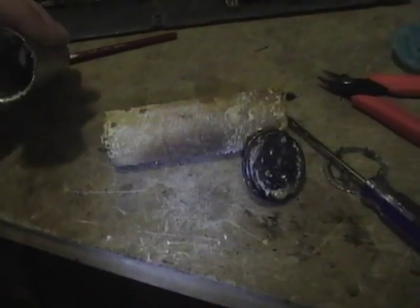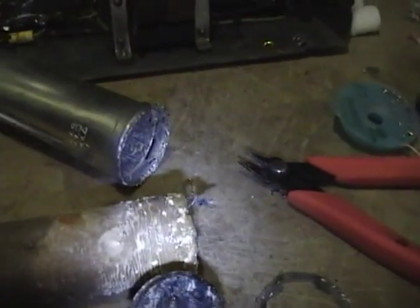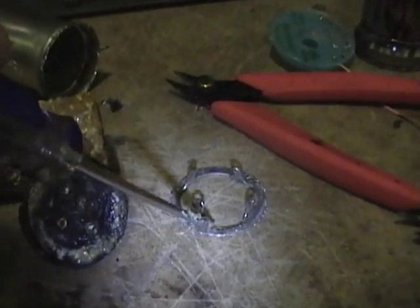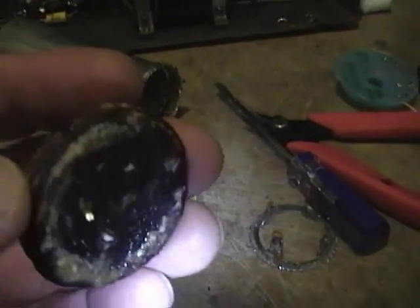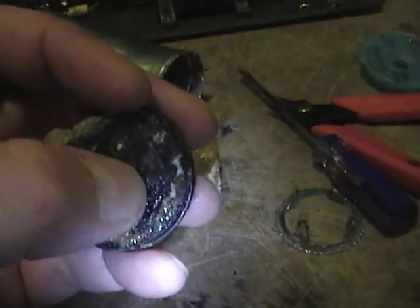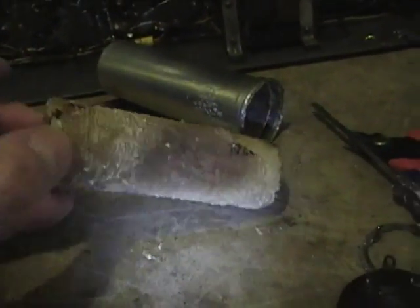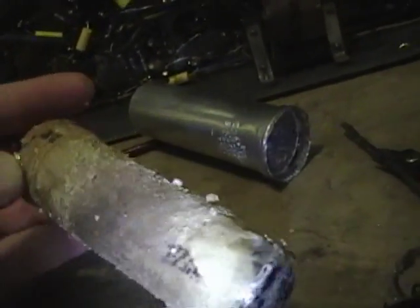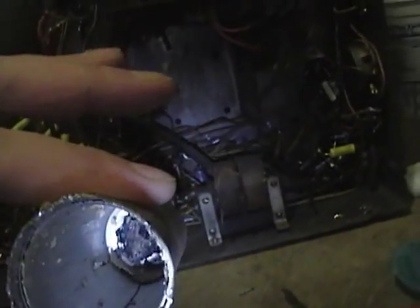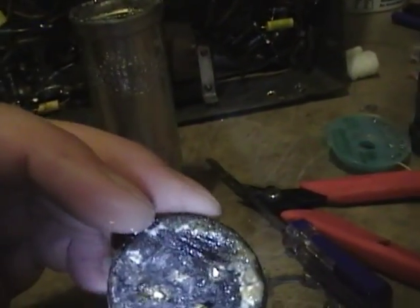Here's the three-section capacitor - I got it open. I used a small flat-bladed screwdriver to work under the seam of the aluminum outer can against the metal ring and worked it open. Then I was able to pry this part right off, and once I got it pried away a little bit I cut off the little aluminum metal connectors going to the jelly roll of the actual capacitor itself. It slid out quite easily - often there's a big glop of tar at the end holding it in the can that you have to heat up to get it to slide out, but this one just slid out quite easily. I'll toss this, clean it up, drill some holes, and mount some new capacitors.